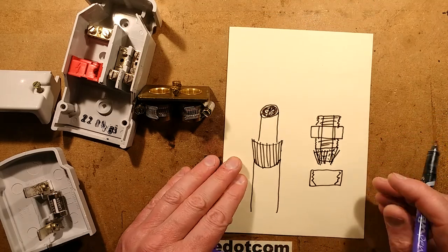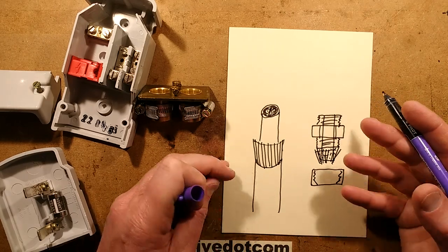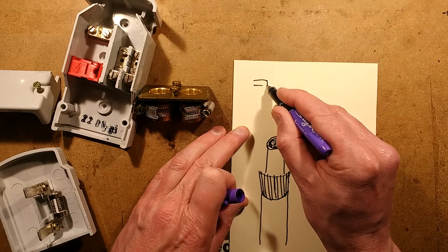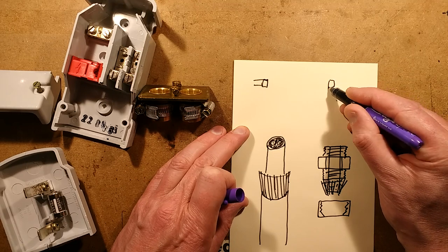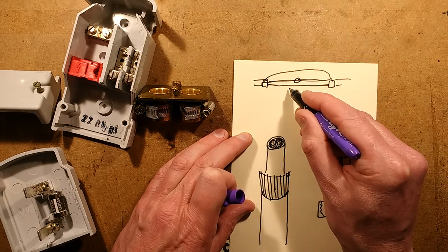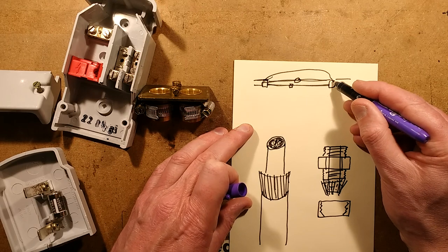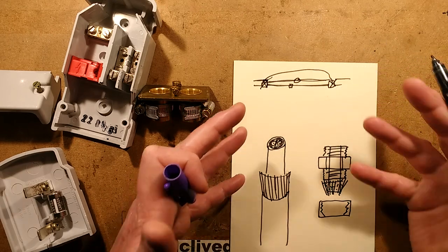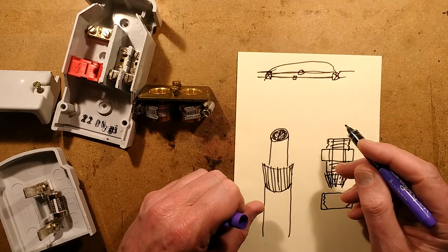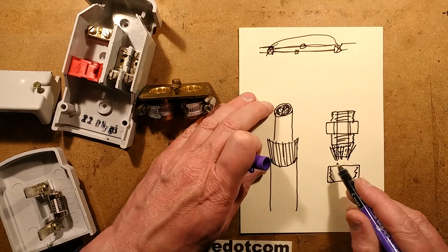One of the biggest and most dangerous incidents in electrical distribution is losing the neutral — the combined neutral and earth. That often happens because when they make a cable joint, they clamp onto the armour electrically either side, splice onto the inner cables, and pot the whole lot in resin. At the point where they've broken the outer armour, those clamps are a weak point. If they burn up, there's no clue until you start losing neutrals and earths at houses, and suddenly all the metalwork becomes live between buildings. It's not a great scenario.